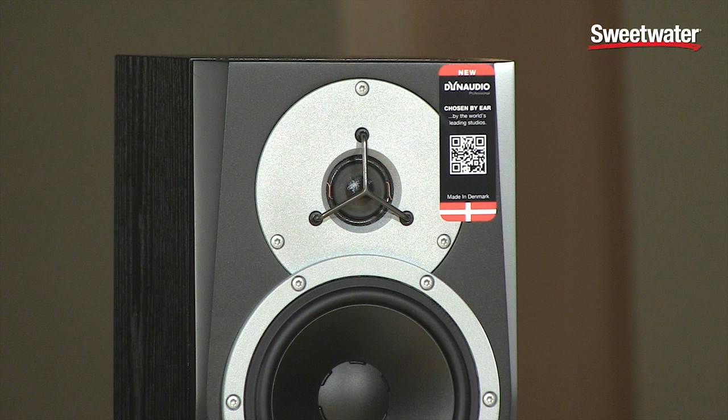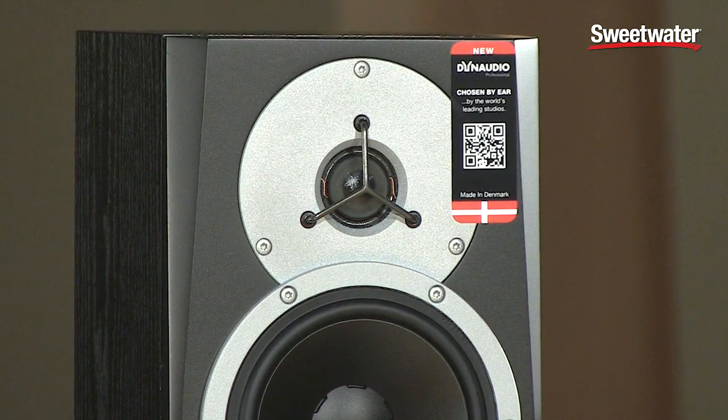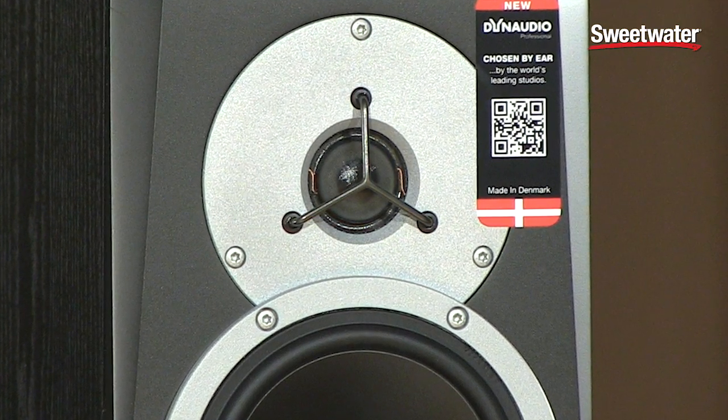One of the significant parts of the Dynaudio design is in the HF driver, where there's a soft dome tweeter. Most dome tweeters are metal and they sound like it. These are actually silk. It's a very complicated process to make a silk dome that maintains its shape and can be manufactured in a production process, and through the 38 years that Dynaudio has been working on this, they've found proprietary methods of doing this. Silk sounds better, and fatigue comes from resonances in an HF driver — resonances translate to ringing, and ringing irritates the ears and causes fatigue.